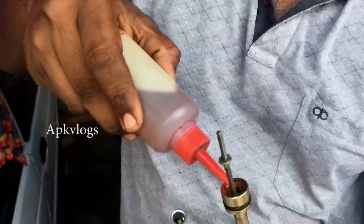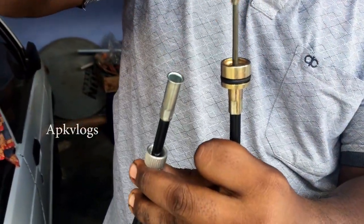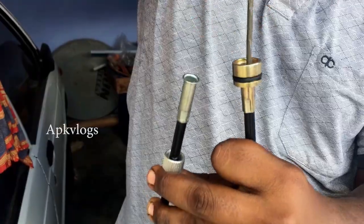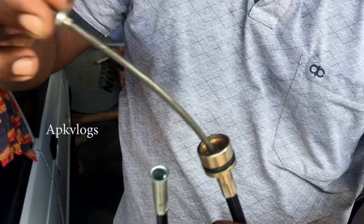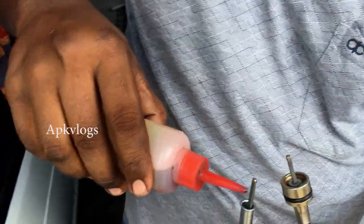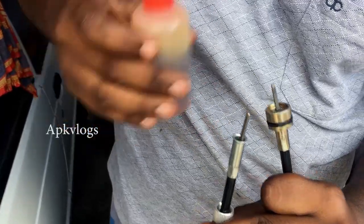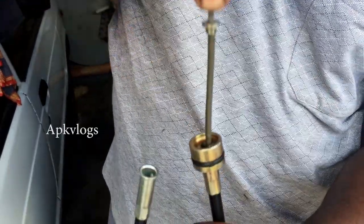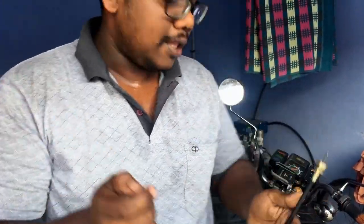Drop it through. On a separate table, if you are feeding the cable from the top, you will put the oil in the back end as well. Rotate it side to side so the cable is well lubricated — you can see there is oil going through. This is how the cable gets lubricated so you can rotate it freely. Let's install it now.